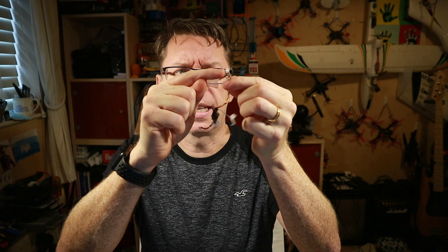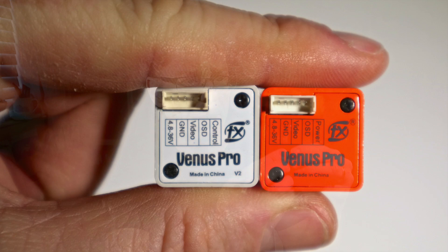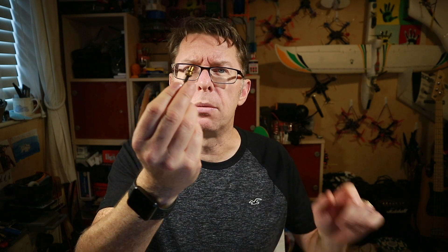It's also already wired up here with power. This is a 5V only powered VTX. And then it's got a connection direct to the camera here, and this is labelled as control. And how this works is in the camera — if we compare it to the regular Venus Pro — instead of the power input you'd use for an external power source to read in the OSD, you've got this thing called control. So in the second section of the box you've got a bunch of cables, some mounting hardware, and a second MMCX adapter with an SMA.